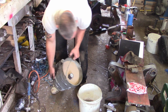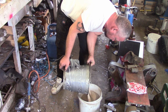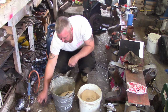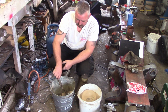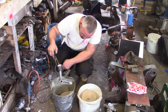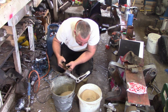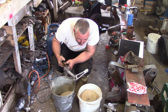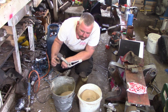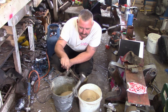Okay. Oh, okay, it looks like we've got a good part. There's a potential for some of these cold seams. I still haven't figured out the name of these, where liquid metal meets liquid metal, but it's formed a little bit of a skin in the mould. There's a couple along the back here. It might cause us an issue, but it looks like we've got a good part anyway. I'll wait for it to cool down a bit and then clean it up.